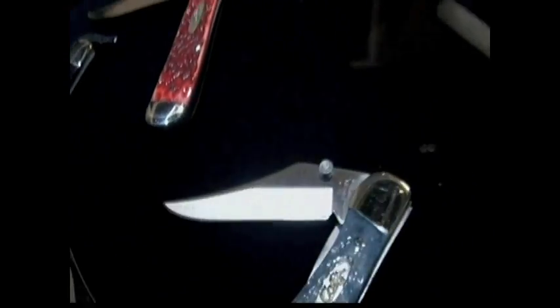The steel is TrueSharp surgical stainless. It's the steel we've been using since stainless steel first came out. Before that we had chrome vanadium — this is Case's original steel. Now we use 420 stainless steel, but we have a fantastic heat-treating process, and that's one of the things that really brought Case to the forefront from the very beginning. Russ Case learned the heat-treating processes, then made his own company — and that's where you see the XX mark. Under normal circumstances some people might think 420 is inferior to 440, but when we're done heat-treating our steel, it's every bit as good as other steels.